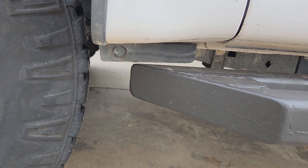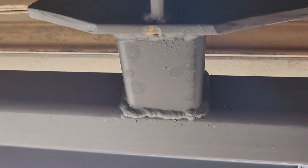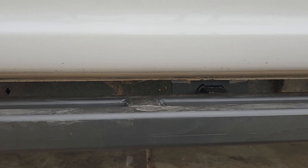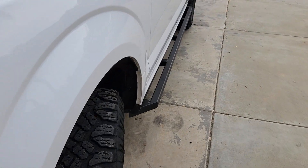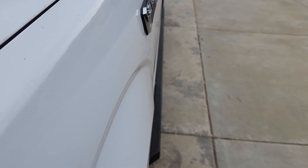Here's how it looks on the truck - set back an inch or so in the front and pretty much the same amount in the back. From underneath you can see the two inch pipe that connects the main sliders to the brackets. We also did a little corner on these so it can't catch rock so much on the very front. You can see my spacing between the door and the rock sliders, and height-wise it's just a little bit above the frame. I wanted it to be a step so I could get in and out using it. Thanks for watching - if you enjoyed this video I'd really appreciate it if you hit that like button and subscribe. We'll see you on the trail.